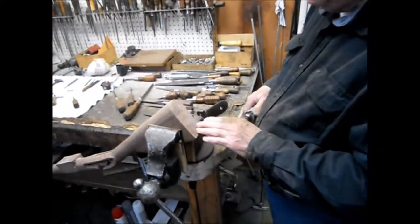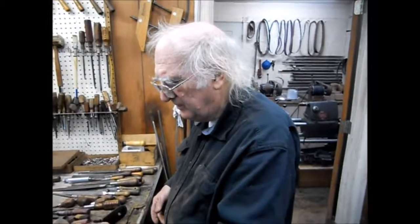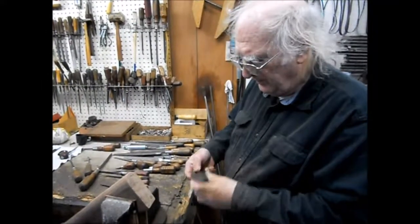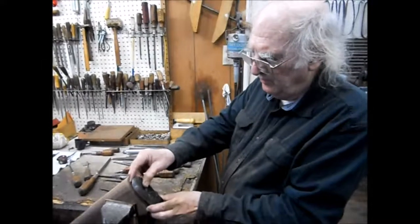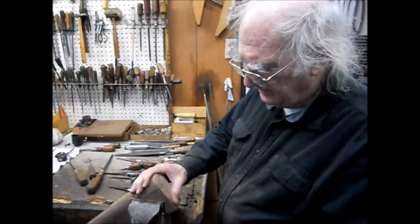If we undercut it, that's all right, because we're going to fill it up with fiberglass anyhow. You got to seal this wood up because it's open grain and moisture can get in there and change things around. In other words, you put the butt plate there and about 3 months later you find the butt plate is moved off or moved around someplace. So you put a little glass bedding in there? Yeah, you got, like I say, you got to seal it.